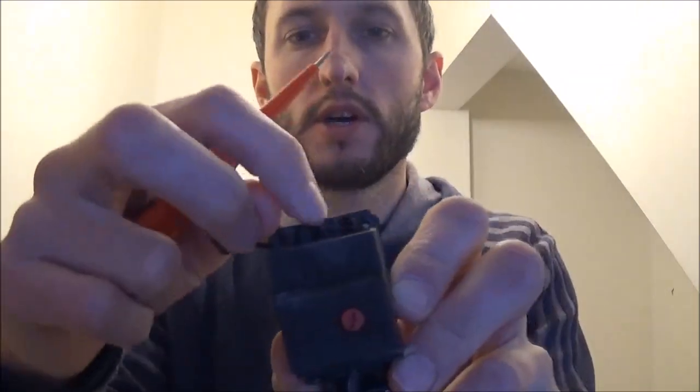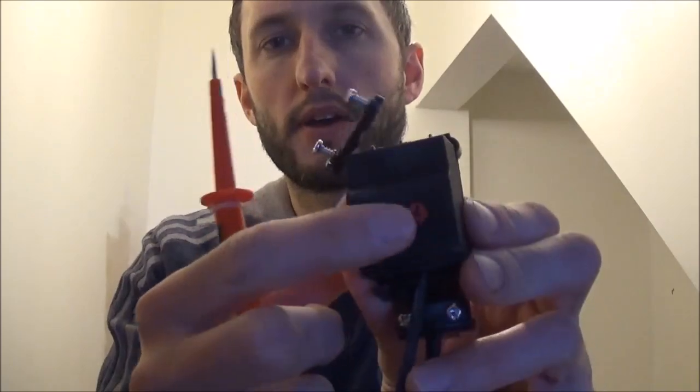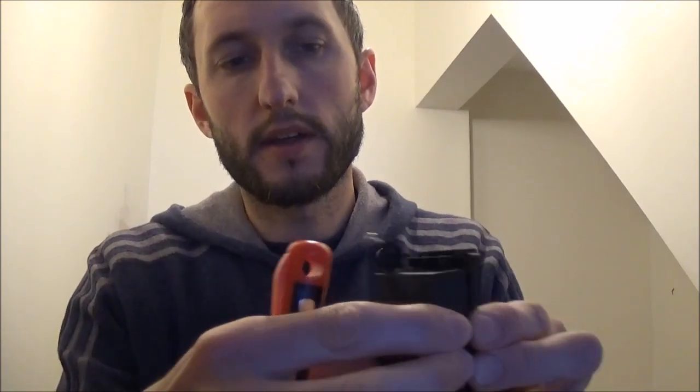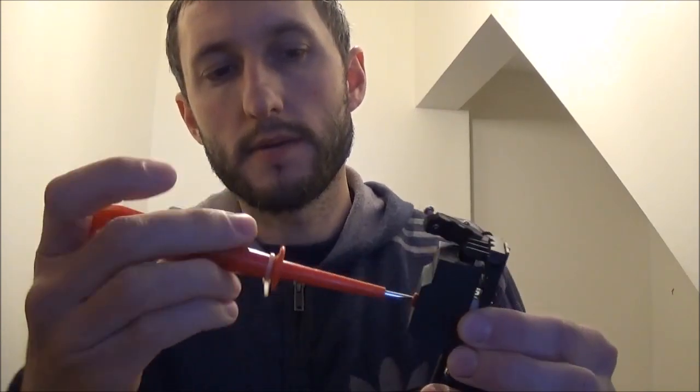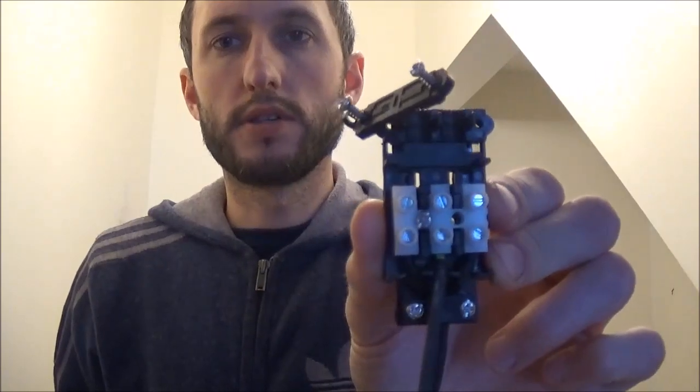First thing to note: you'll see there's a cover to strap your cables in, so you need to unscrew those. By here you'll have this little red bit — and whatever light you're using will have something similar. You just need to undo it, and if you look inside, it's just a plastic screw. That screws into the hole, and inside you've got your connector block. It's quite straightforward — as long as you've got your wiring sorted, this should go in no problem.